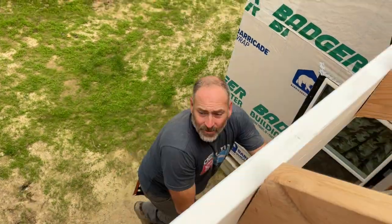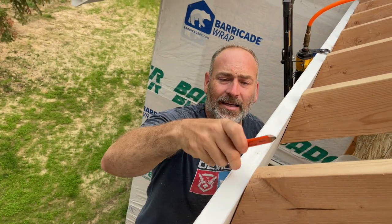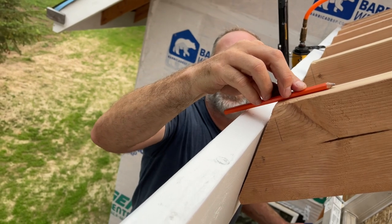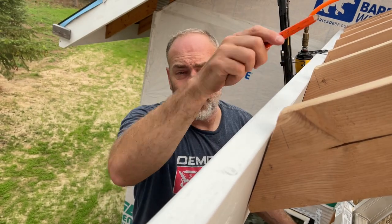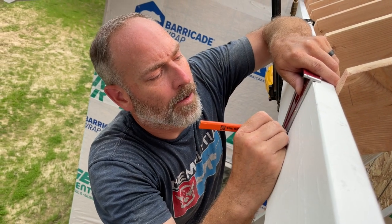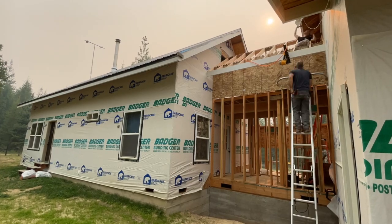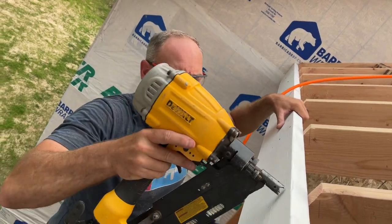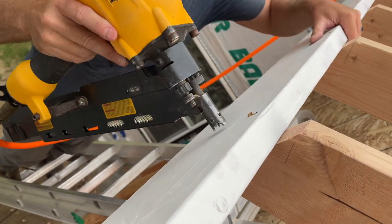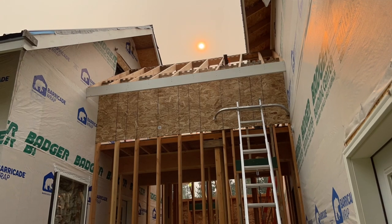Fascia fits good. We got her all lined up. We just got to put all the nails in her. It's dropped down like this because the OSB is gonna come down like that, all the way out to the edge here. It's a 9-12 pitch roof, so it's dropped down pretty far. If you don't use galvanized nails, you get big rust streaks. All right, we're gonna be sheathing this side.